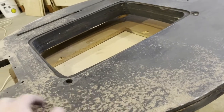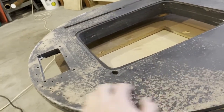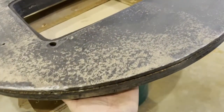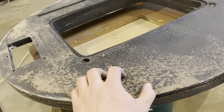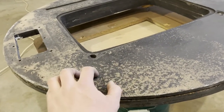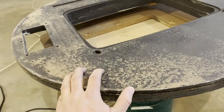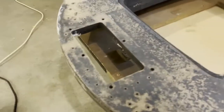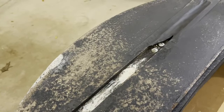I went over the whole top — at least this side — with 80 grit on my orbital, kind of worn down, then went back with 120 and hit the whole top. I hit the bottom up into this wood block, the wood square in the center, just to get it ready for paint. So where these holes were, we ended up epoxying them in — very swollen wood out here. You can see we had to epoxy some in.